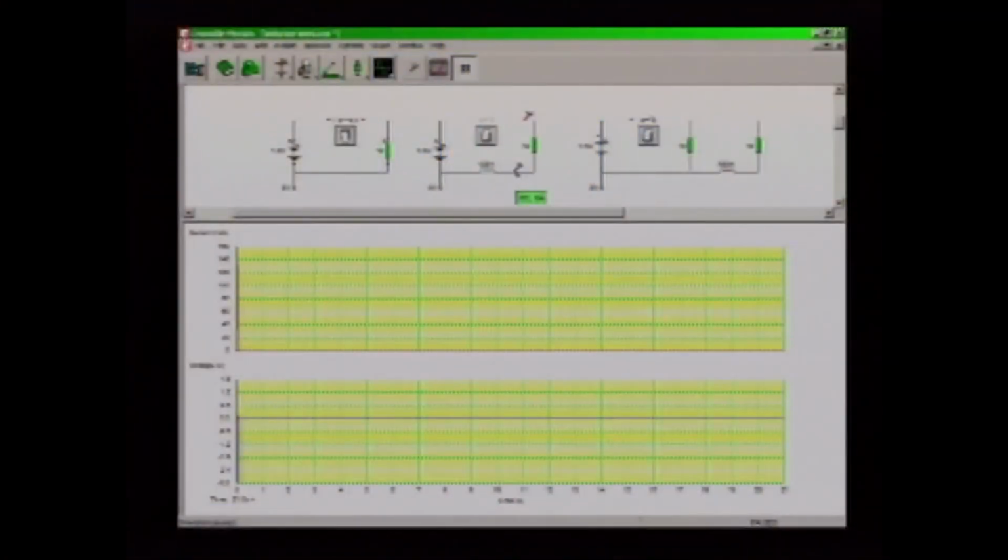The motor has a large inductance and it resists a large change in current, so it can actually create a high enough voltage to drive a current through the air, which we call a spark. So it makes a big spark, which also can cause damage. So to avoid that kind of damage, I have my third circuit over here.